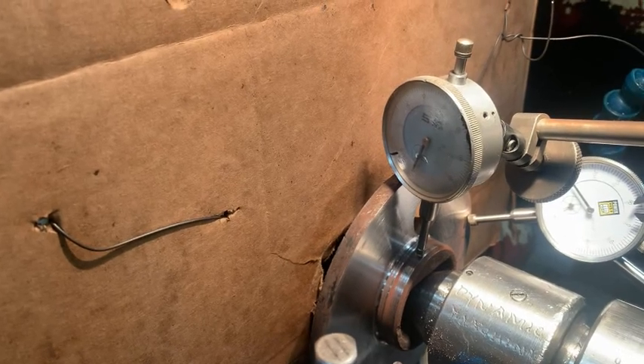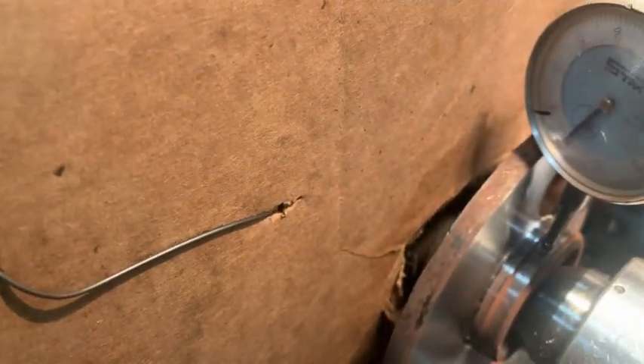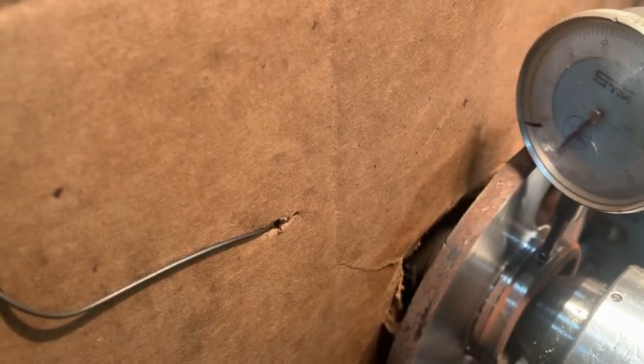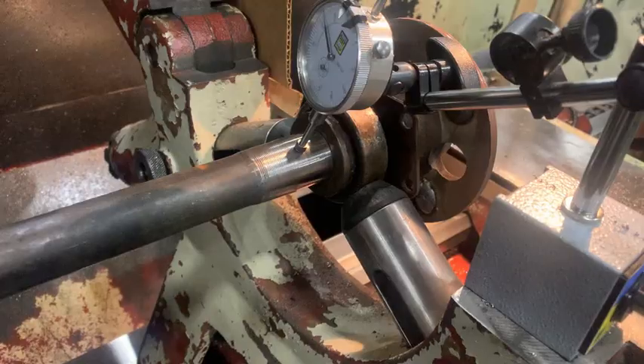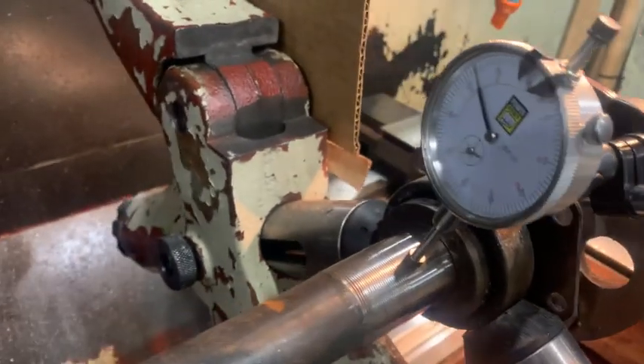So I'll probably just show a video of the other one. It's relatively straightforward — I just use a 3/32 rad in the corner and basically replicate the rad. Pretty straightforward to do the other side; I just grab it in the 3-jaw because my 3-jaw is good. You can see this side on the back, I bet it's running about 15 thou right now. Generally when they did them, they were close and that's it — even look at the axle when you spin it up, they're not true.